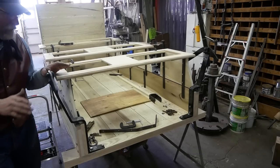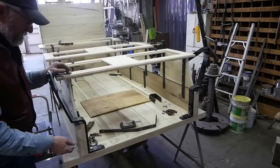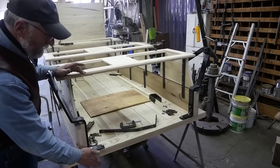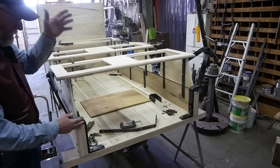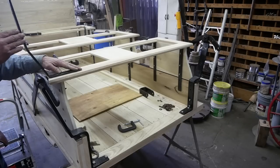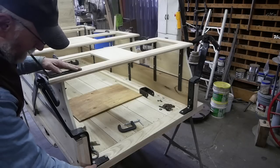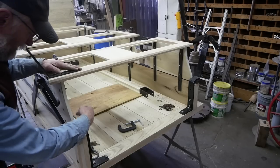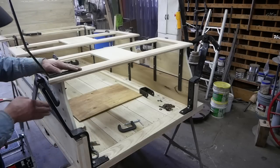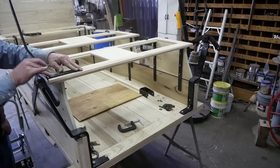So again, going to the back of this coach, the way I think it has the structure, as best I can tell, I couldn't imagine any framework that went from the main body frame to the top. That's why when I saw these irons, I thought, aha, these would attach the top frame, fastening down through the seat framework, attached pretty solid to the frame, especially since these side irons to the seat risers are bolted right through this frame. I could see a good line of connection strength-wise to the back of this coach. That's where I put these irons as top irons.